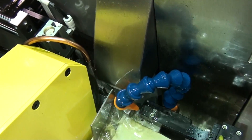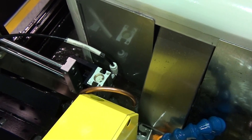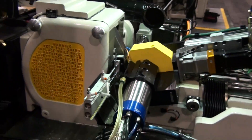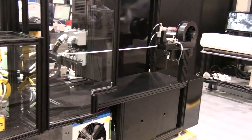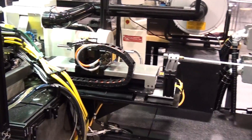A spool of raw material is positioned on one end of the machine. The length of material is automatically pulled out and cut to length at, let's say, 1 meter. The raw material length is brought to the grinding zone and the part profile is pre-ground with the primary wheel, while being supported with a D2 support shelf and carbide back support.